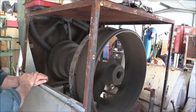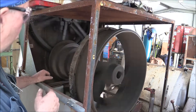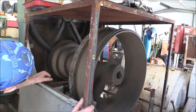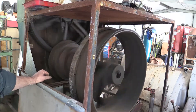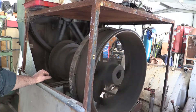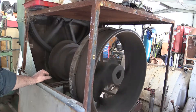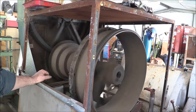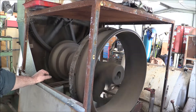Now we've got a fair bit of rumble here. The flywheel's got a bit of run-out in it. I suspect it's the wrong flywheel — I don't think it's actually got enough mass on it. Sounds like the gear mesh isn't as good as it should be. And it appears to have a crack in the bull gear, which means there could be a crack in the outside of it — it's got a crack in the hub.